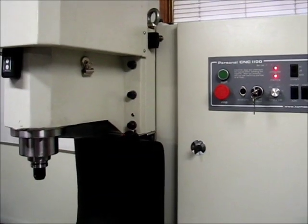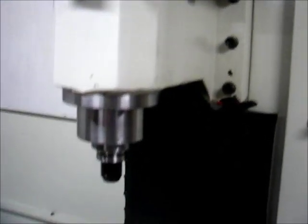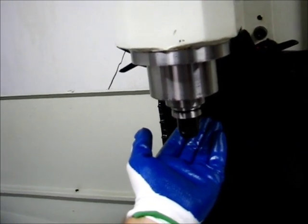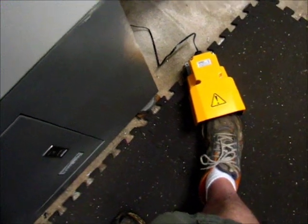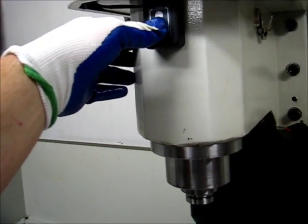The mill is powered up. I'm going to start the motor — again, the belt is off still, so the motor is running but the spindle is not turning. We'll test whether the power drawbar interlock works. I'll use the foot pedal first — nothing there. I'll try pressing the button — and nothing's working there either. So it looks like that did the trick.